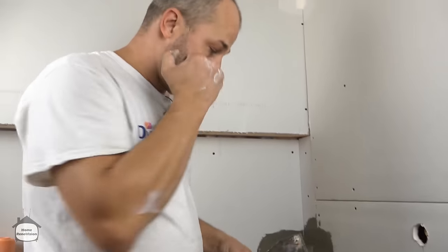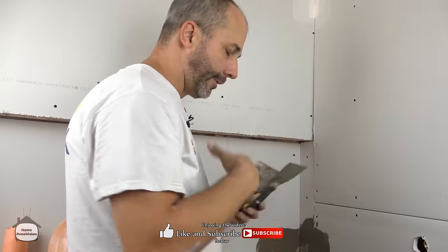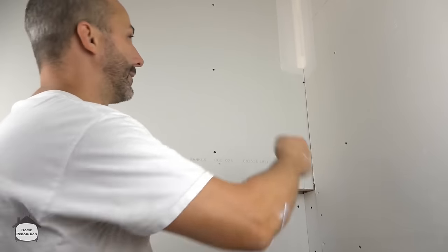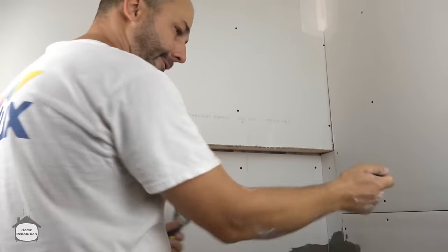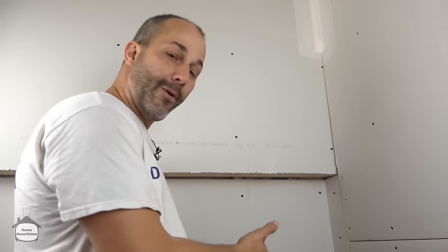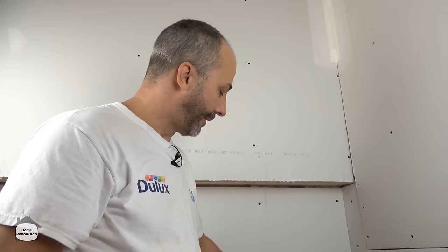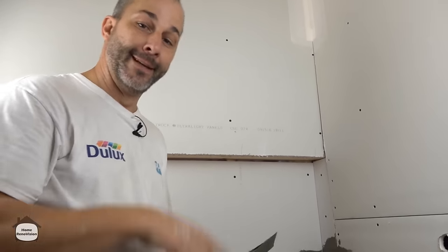Now I realize in a lot of situations, you know, we go a little overboard. We waterproof up above our heads. It's extreme. This is not going to be a closed-in shower with steam. So what's the point? Well, here's the thing. You have an overhead rain shower. It doesn't make a lot of mess. You don't get water everywhere. But when you're done, you take off the wand and what do you do? Yeah, that's right. You're firing water everywhere. You're washing down your walls. You're filling up the cavity in the shelf with water. That's probably going to get more water is when you're cleaning than when you're actually having a shower. So that's why we take the time, make sure our ledges are sloped, everything is waterproof and sealed up, and that is the key.